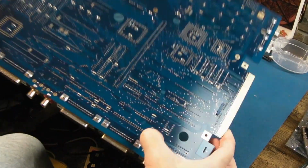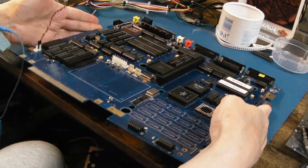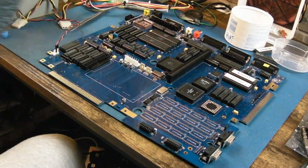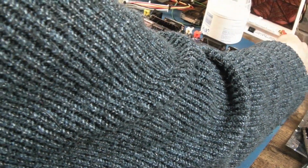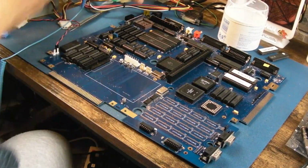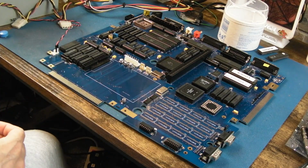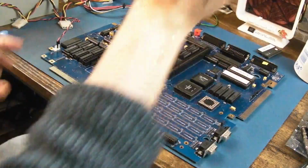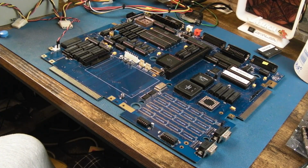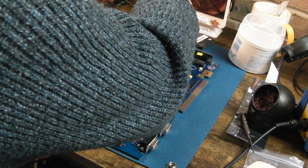Alright, that's the floppy drive connector soldered on there for the internal drive, and the ferrites there for the external port. So in theory, internal and external floppy drive should work now, unless it needs that 7406. I can't honestly remember whether that's something to do with serial or parallel, and I don't even think there usually is a 7406, so there are some differences here. The question is, is that 7406 needed with the 1488 and 1489? In fact, now I think about it, don't you need the 1488 and 1489 for the floppy drive? Maybe I'm imagining things. There's some relationship there somewhere, maybe. Anyway, let's just try it.